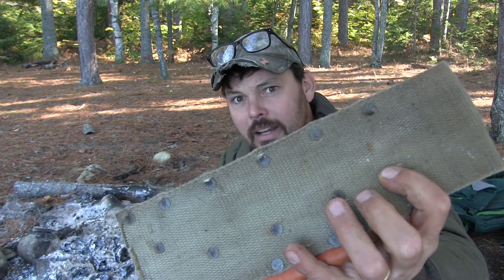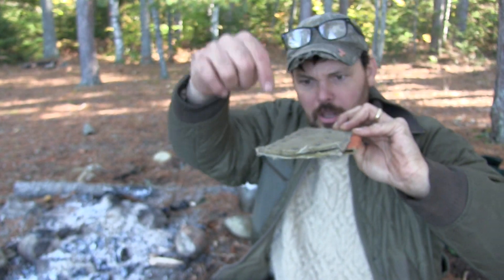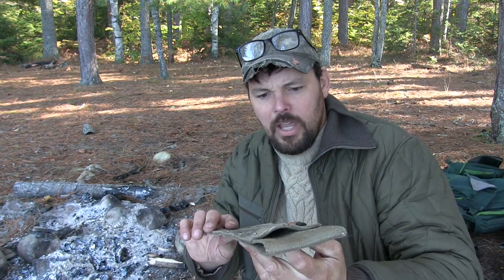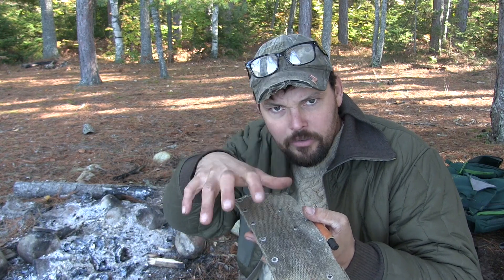This is the case I made for it, and it's made out of tie-down strap from a semi truck. You can see the rivets I used — they're actually roofing nails. I drove the nails through two plies of ratchet strap tie-down, put a washer over each one, clipped the nail off, and then peened down the end of the nail so it filled out and held the washer in place.